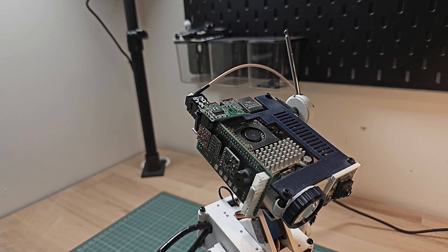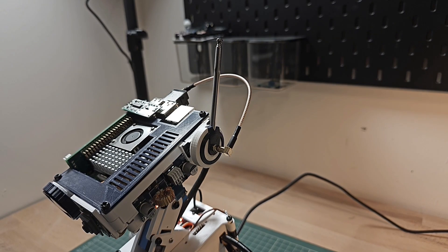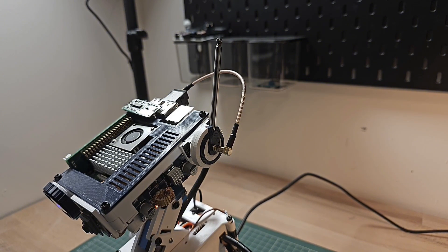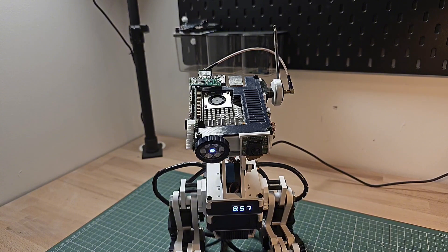You can see a motion sensor here — a microwave motion sensor that allows you to detect motion through walls or anywhere near the robot. It doesn't need line of sight. It's a five-volt module but outputs three volts so it can communicate with the Raspberry Pi. We also have a servo connected directly to the Raspberry Pi on the head. At the moment it's connected to an antenna. There's also an inbuilt temperature monitor on the Raspberry Pi — a module can check that and broadcast the temperature every minute. If it's running too hot, you have the ability to commence an emergency shutdown or warn the user.